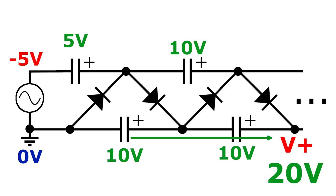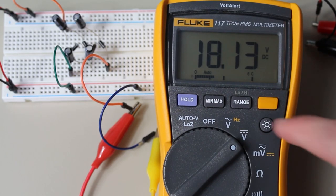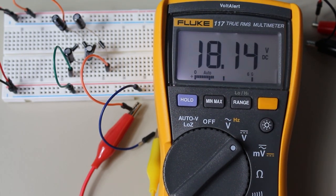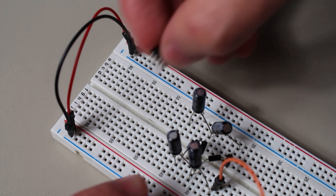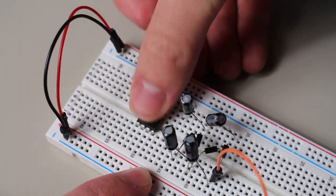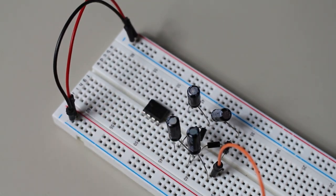The best part about the circuit is that it is repeatable. Just add another pair of diodes and a pair of capacitors and you will multiply it twice again. This is an amazing multiplier, and you can get really high DC voltages using this method. Plus, it's much cheaper than buying a transformer for stepping up voltages. But it isn't the DC to DC converter like I promised. We still used AC at the start. So, let's make some changes to correct this.